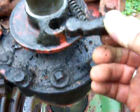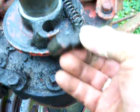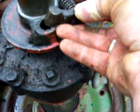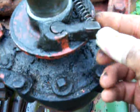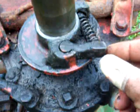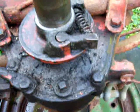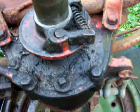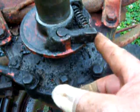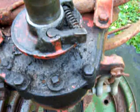You want to take this apart, wash it. The simplicity of these Bradleys is what I love — the pawl comes right out, no special tools needed. Take the spring out — sometimes the spring loses its spring and needs to be replaced, I've done that on one. And on the ones with reverse, they have a mechanism that flips the ratchet from one side to the other, exactly like a regular ratchet, putting the strain on the teeth to go the other way.